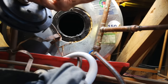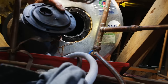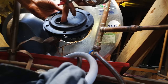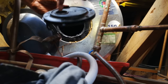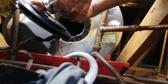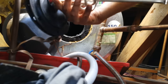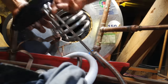You can see how you line up the holes — there's the hole for the earth, and that's where the element is going. It can only go one way: it's got a recess here and this has a raised area. If you look at the face, you'll see the thermostat tube must fit in there, so that is why it can only go one way.